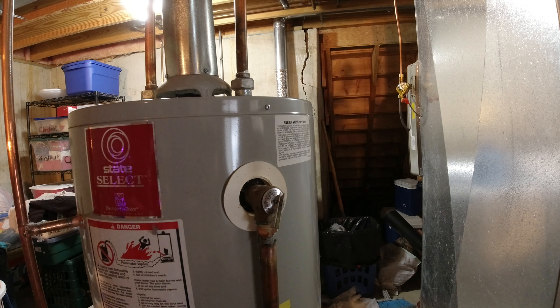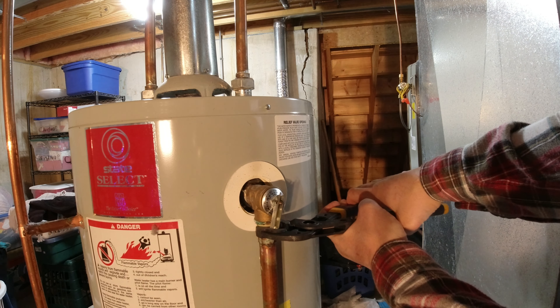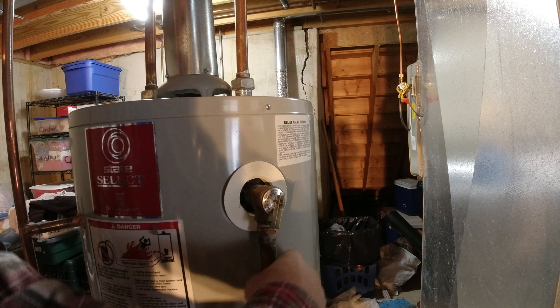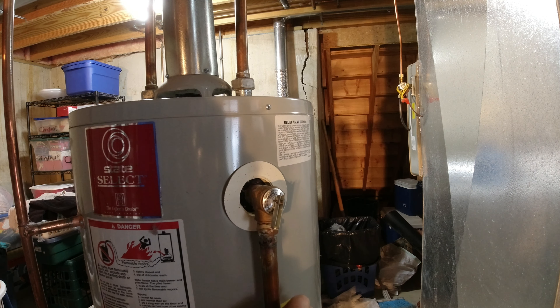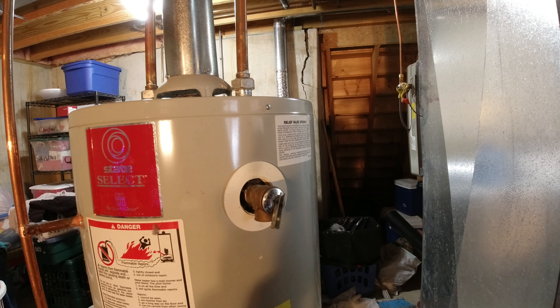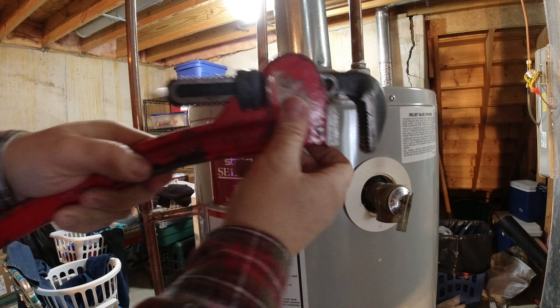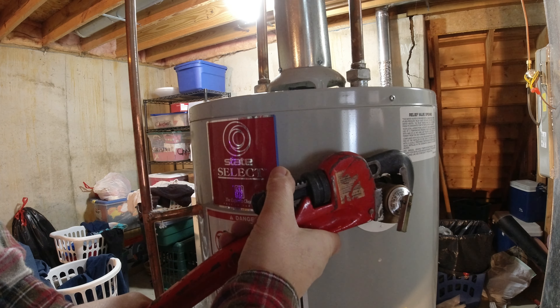At this point you can turn off your lower valve also. We'll start with - you can use your crescent wrench, but this pipe should not be very tight. I'm gonna try using tools that most people have in their house. Alright, so there's the drain tube, and I can't stress enough: make sure this thing is drained. We're gonna have to use a pipe wrench on this, then just unscrew it.